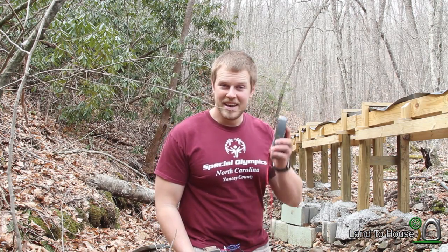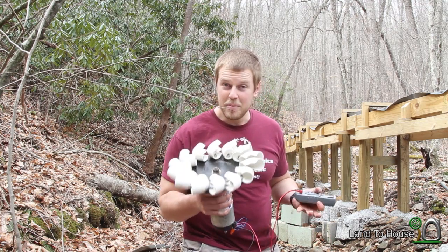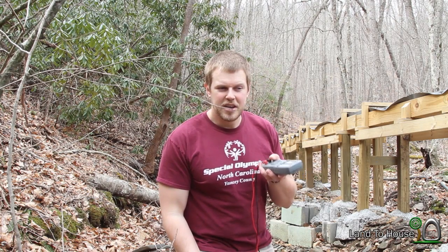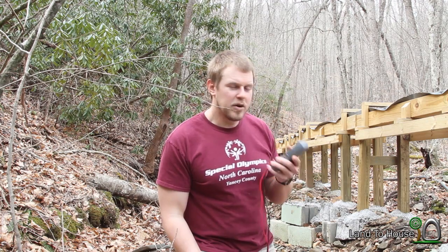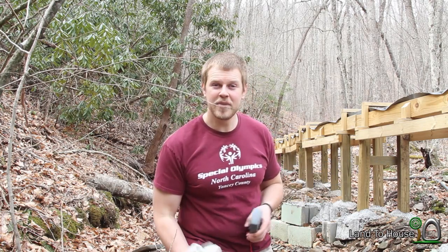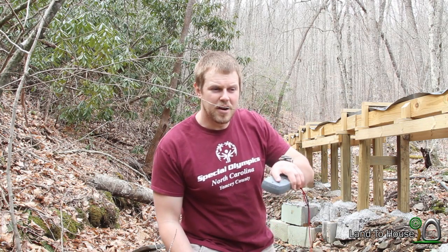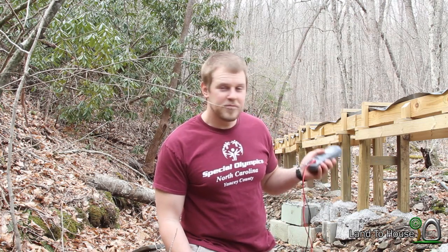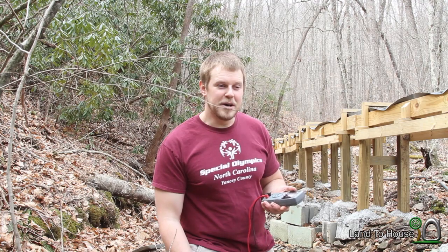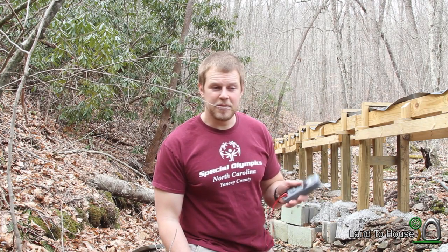I apologize for the audio in these clips — it's hard to record next to that waterfall. This thing is of course extremely inefficient, but I think it gave us some pretty decent results. That was 4-point-something with the bigger nozzle and 2-point-something with the smaller nozzle. You can nozzle it down too far, and no nozzle doesn't give much electricity off this thing at all. I think our feet of head here is somewhere around 5 to 6. You can do the math on how much flow through a 1 and a quarter inch pipe should give you, but I'm assuming with that ram pump adding pressure to that nozzle, you're getting more than if you just nozzled down pipe by itself.